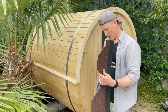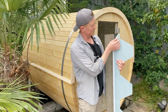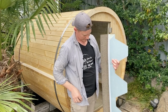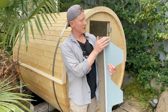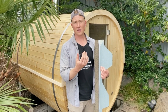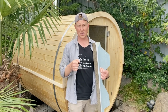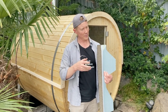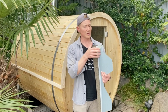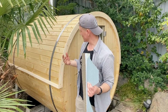Now the shingles come with a self-adhesive, so when we install them, we'll peel this film off, and it may not stick immediately. It needs a little bit of heating treatment, so you could use a heat gun to heat it up and then it will stick, or you could also leave it on a sunny, hot, warm day outside and it will stick over a couple of days.